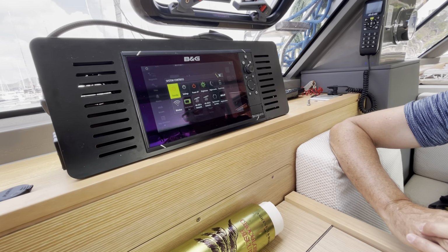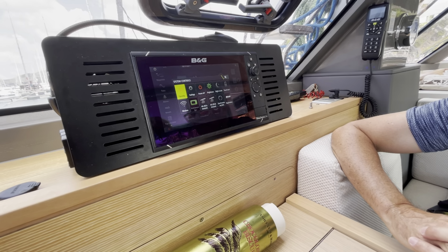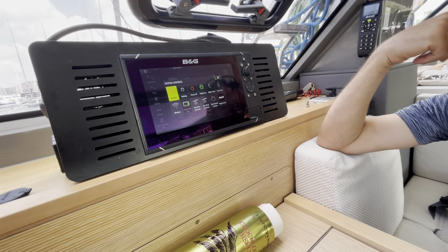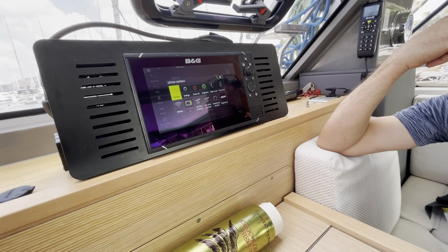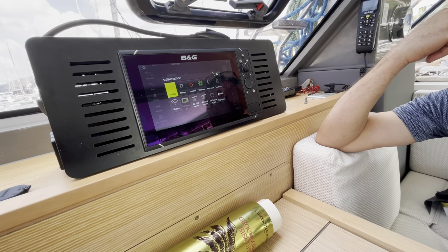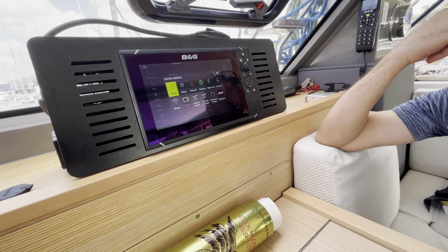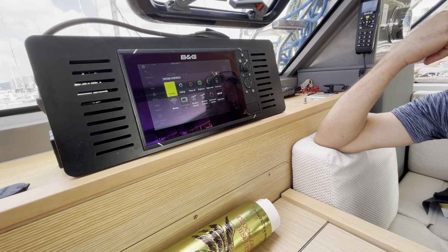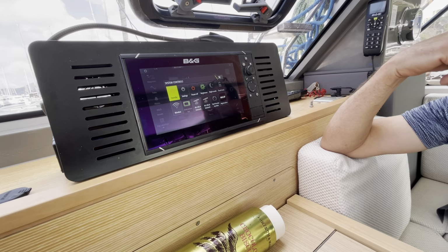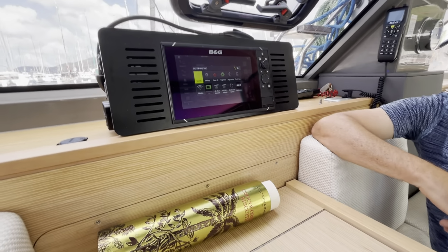For lithium batteries, you want a little bit of current going through. So we turn on one of the LEDs in one of the cabins just to use a tiny bit. What's the reason for that? Apparently lithium batteries like a tiny bit of draw. They don't like to be absolutely static. It was described to me as it becomes like a tide mark. If you have a little bit of draw and it's emptying overnight and recharging again during the day, it preserves the life of the batteries. Better. Do you know what the life cycle is on these batteries? I don't. No.